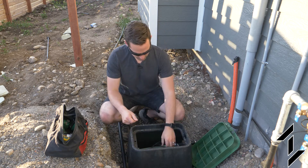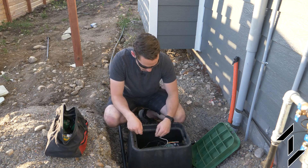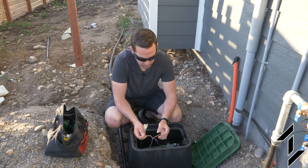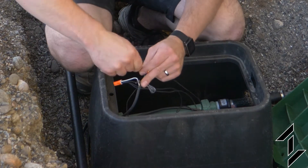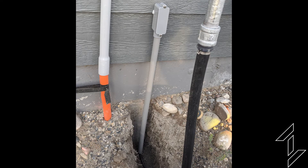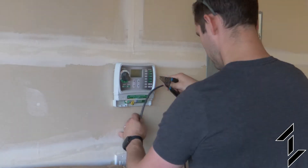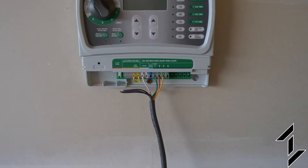It's been a couple of days and the sprinkler controller has arrived. I also found the bag with the wire nuts for connecting the valves up to the sprinkler wire. We're going to start by grabbing one wire from each valve — it doesn't matter which according to the instructions — and tying that to the white wire. That'll be the common node, and then we'll pick one of the three colors for the three zones to tie to the remaining wire on each valve. One quick note: I ran the sprinkler wire up the side of the house in a gray PVC pipe into a junction box and then into the crawlspace — this will protect it from UV exposure or getting whacked by a weed eater. The last step is installing the sprinkler controller and connecting up the wires, which is as easy as screwing the controller to the wall and connecting the wires to the terminals that correspond to the different zones.